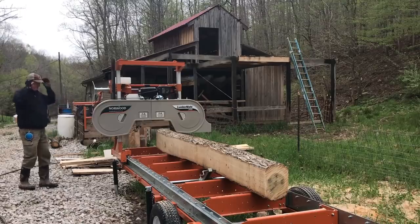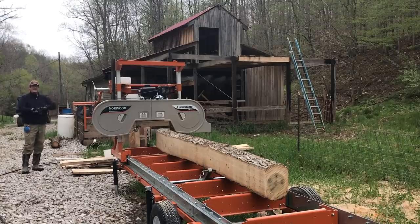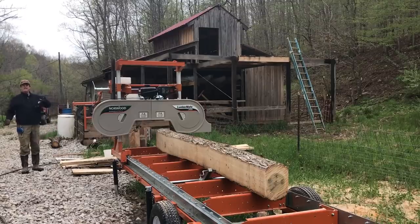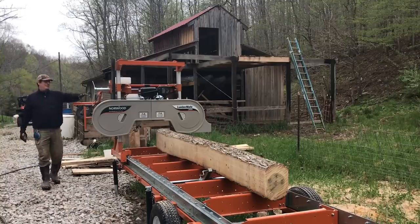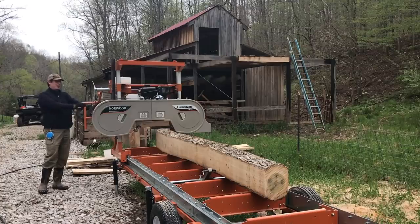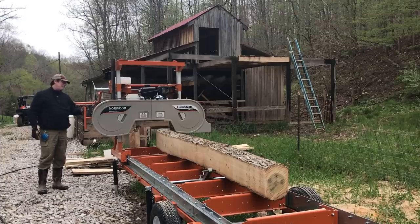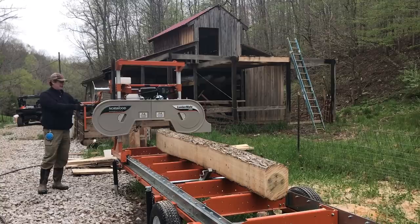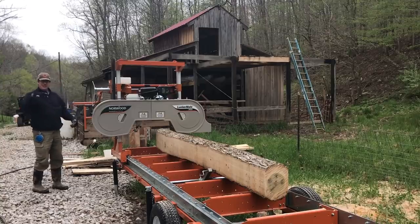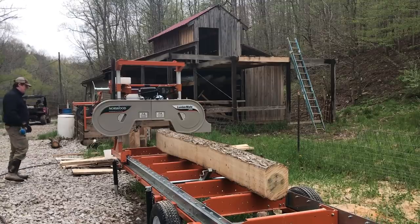Okay, here's a good example. Step back from the engine a little bit. So you hear that rattle. I've had people complain, say, man, that thing rattles like crazy. Rattle means metal fatigue, metal wear, that's a problem. Well, really the only rattle I have on this machine is what you're hearing, the handle. This handle is just made to be on there loose, so as I'm turning it, it turns in my hand, I don't have to slide my hand across it. While that's a little annoying, it's not a structural integrity issue. In fact, I could probably put a little rubber gasket on there or an extra washer and take that out. I could tighten it down more, but it would take some of the nice rotation out of it. So while that sound is a little annoying, it's not affecting the wear and tear or the integrity of the machine.